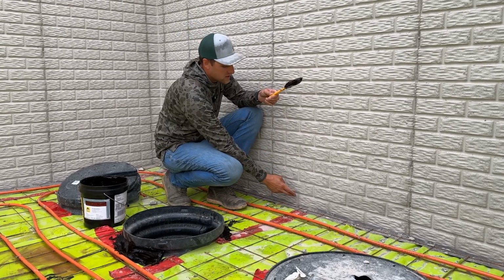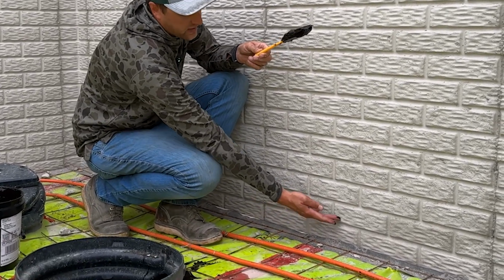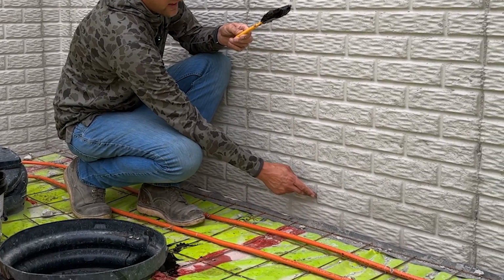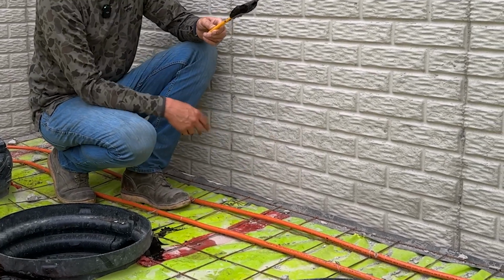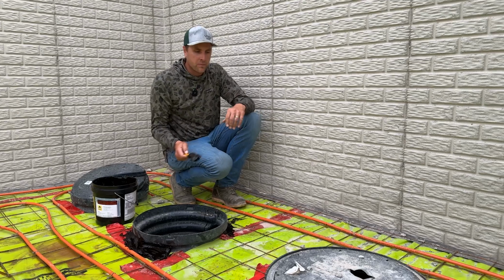On our concrete walls, you can see they put a brick pattern. Well, if the concrete comes here and doesn't fill that gap perfectly, we could have air gaps up around the outside. So we'll make sure we seal all that and go around the outside.